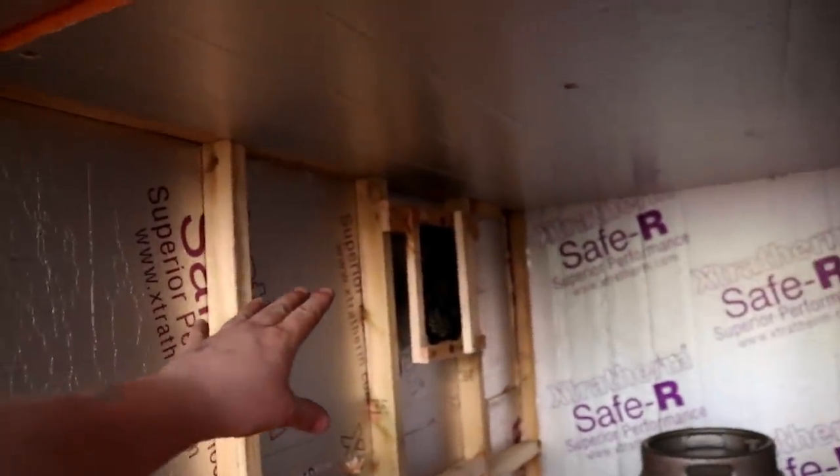The glycol's recirculating nicely, or the glycol bath. I will put glycol in here in the winter so it doesn't freeze. But you can see the ripples on the surface. Definitely recirculating. And this top pump is more than powerful enough to recirculate through there, all the way across, through one, through two, through three internal cooling radiators. So I think I'm just going to give these pieces of timber a spot of varnish before we put them together. And I think we've got the beginnings of a fully functioning cooling system for the cold room.